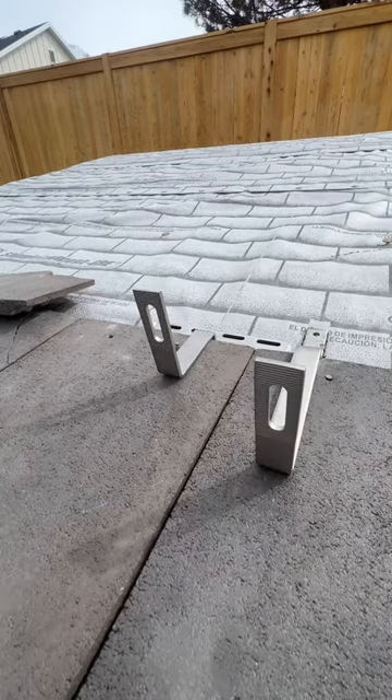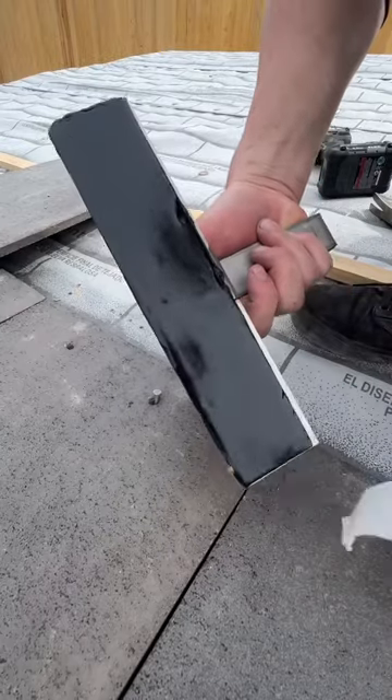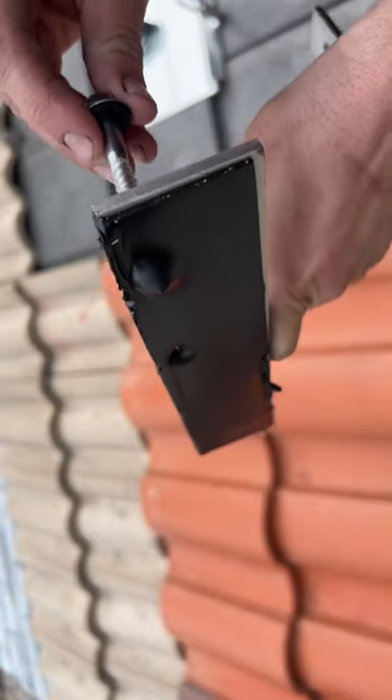I'm checking out the three most popular tile hooks from K2. The best thing that's ever happened to tile hooks is the ever seal coating that comes on the bottom. When the lag screw goes through the butyl, it pulls it down into the hole and seals it off.